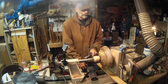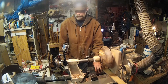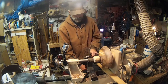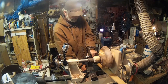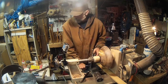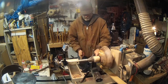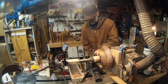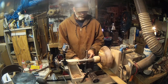The other problem that I'm still having is that I polish the ways on my lathe on a fairly regular basis to make sure that I keep all the rust and nasty stuff off of it. Over time they've gotten kind of slick. So now the banjo itself wants to slide. So what I've been doing is putting the banjo into place with a rubber mallet, and then it doesn't move. It just makes it really hard to get undone. It does still move sometimes.